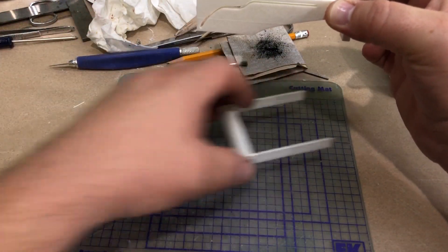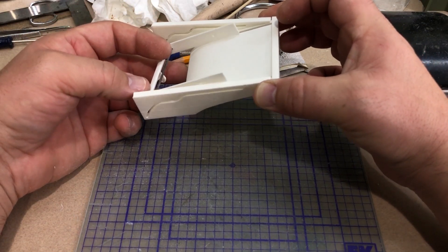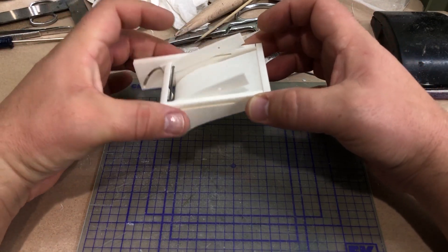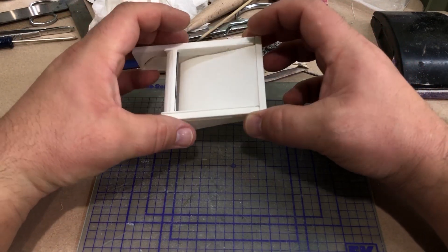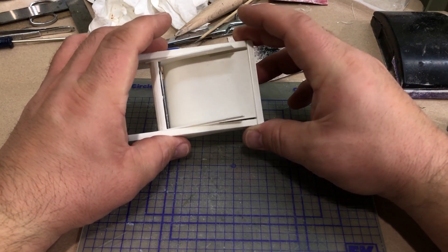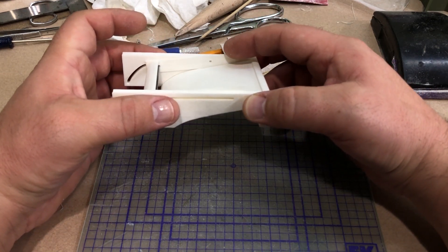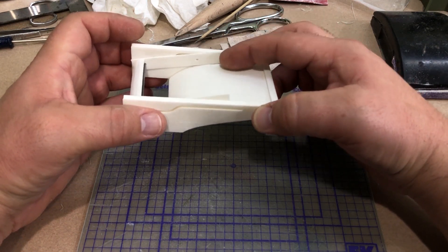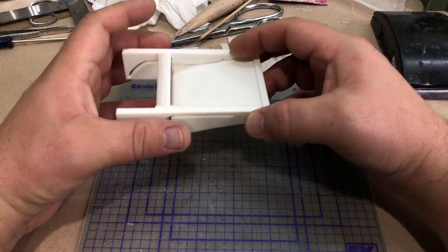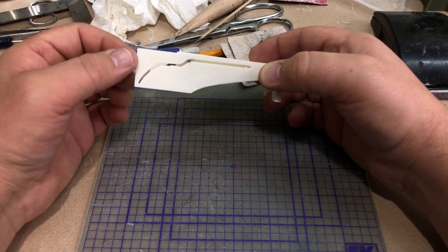The carrier fits into the groove. Looking straight in, I've widened the holes a bit and went through several iterations to make sure that was right, as well as ensuring that when this goes down, the carrier isn't bumping into the recess in this plate. Making sure the grooves were the right size as well.